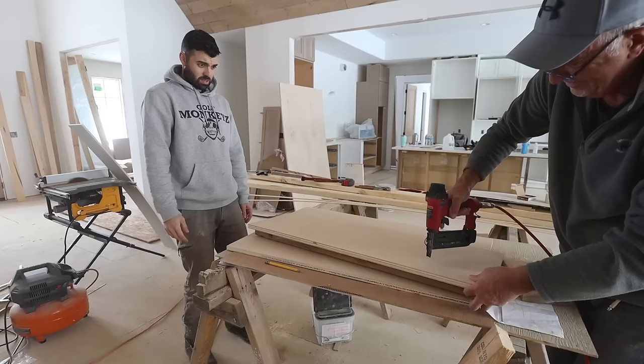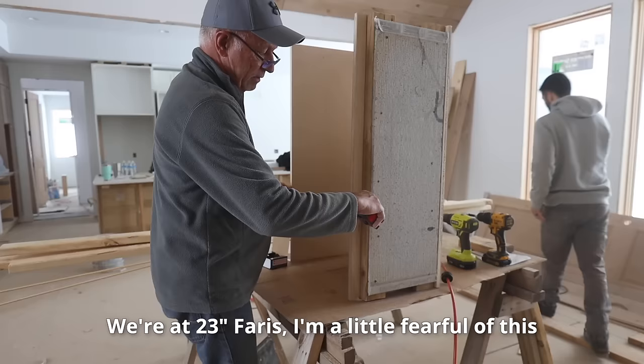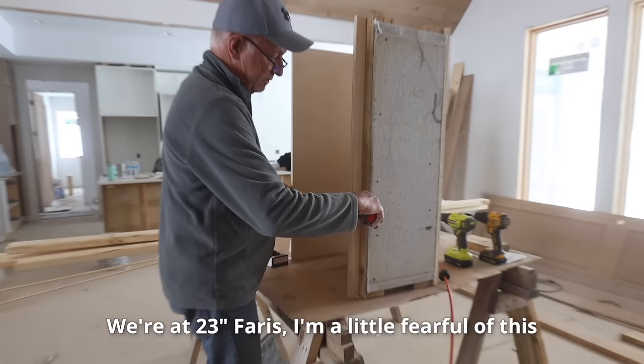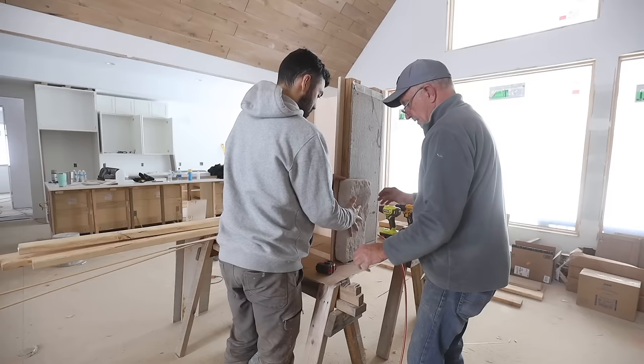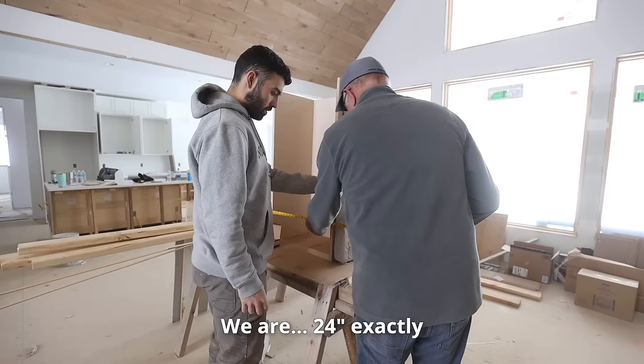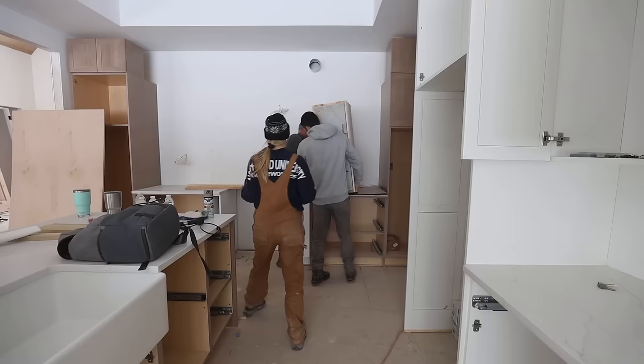We're using duroc or cement board on the face because we need a masonry material for the stone to attach to. We're at 23 inches, and there's some concern. With the stone, we end up at exactly 24 inches. We're using the same stone as the exterior of our house, which is a manufactured stone.